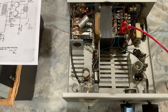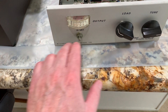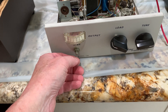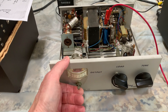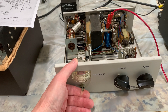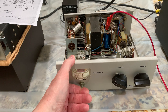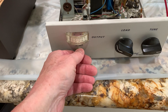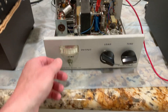On the later models, they added two more switches, and the last ones had four switches across the bottom. One switch was to turn the receive preamp off. What I could do, when I figure out why this switch isn't working anymore, is put a three-position toggle switch — off, standby with no preamp, and on with preamp. I can modify it just by changing the switch, because I don't want to drill holes — if I don't get them level, it's going to look like crud.